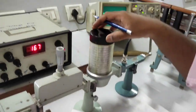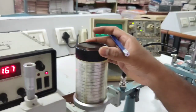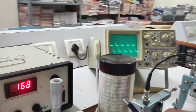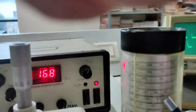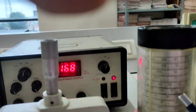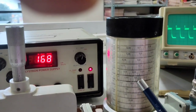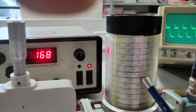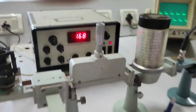Once more: the signal is a square wave. Tune the plunger and get the dip. The vertical thin line coincides with the scale lying between the two horizontal dark lines. Reading gives 9.51 GHz. The first method of frequency measurement is now complete.